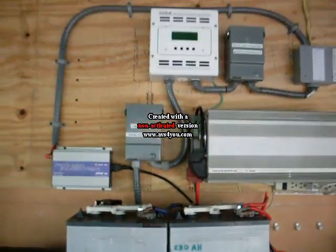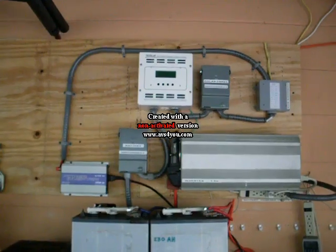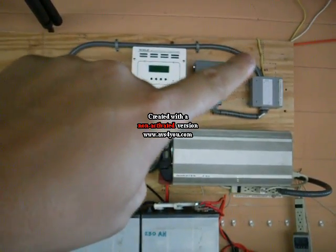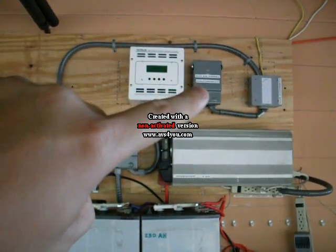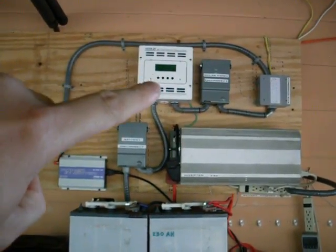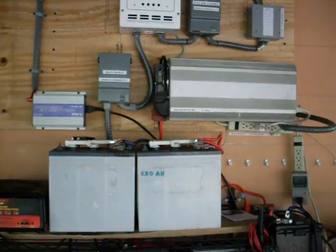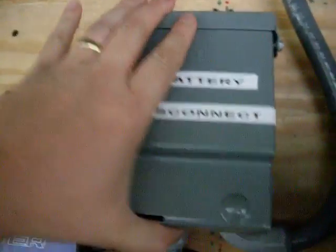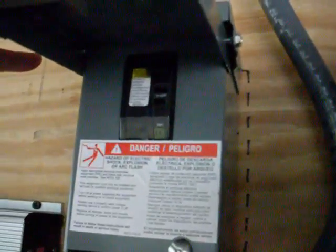The other thing I want to show you is I cleaned up my solar items here. All of my power comes in from the panels into the converter box, through here — this is my solar disconnect box for the panels — which then goes into my charge controller, then into another disconnect which feeds into my battery bank. It's pretty simple. They're both the same: 60-amp Square D double-pole fuses.